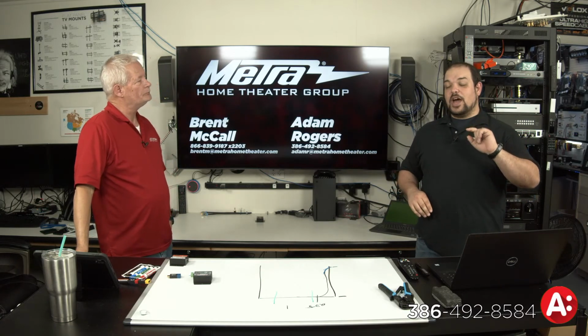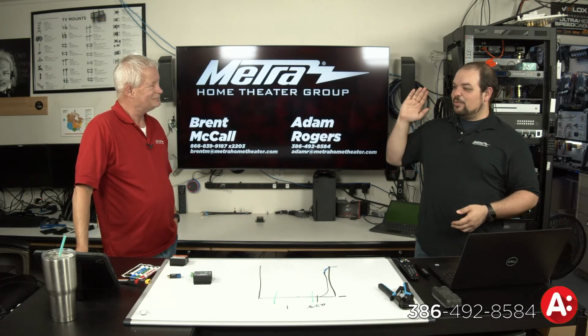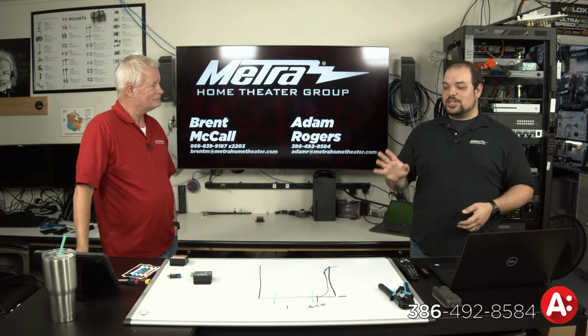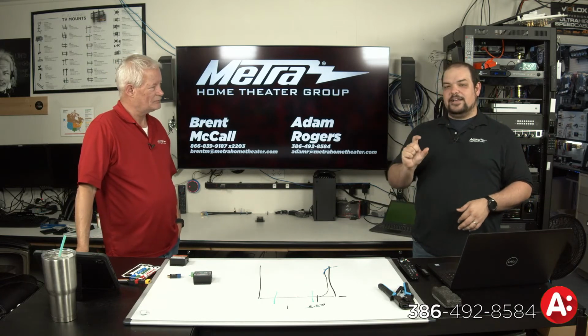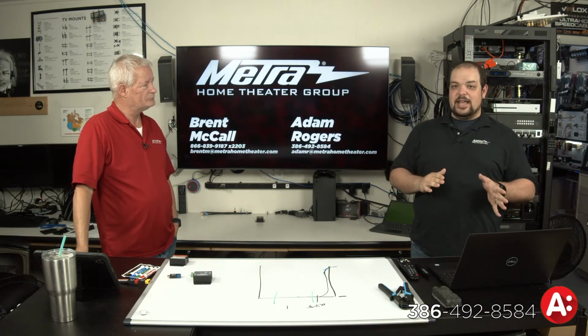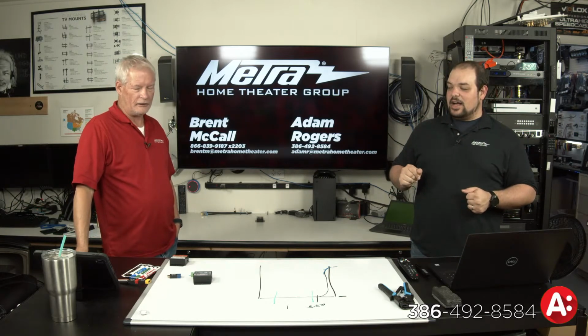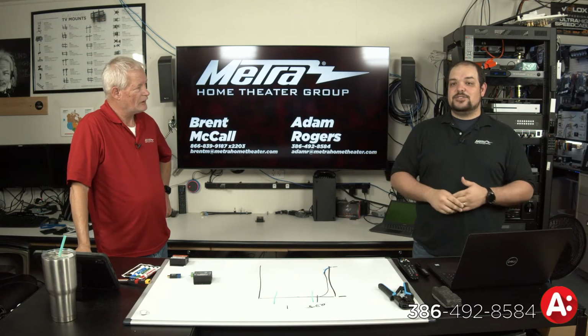Now, the other thing that this has, Brent, we won't go into the backstory, but essentially we found out we needed this device because of the AIO2. What it has on it is a single pole dual throw relay. So an A close, B close. Or NO and NC relay. C for you old guys. Right. And it has that built directly into the IR block.